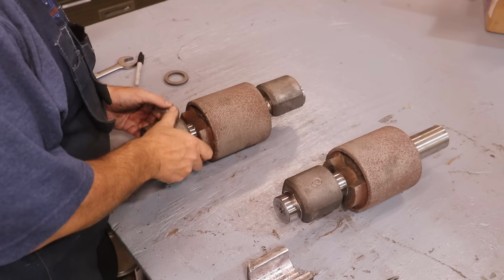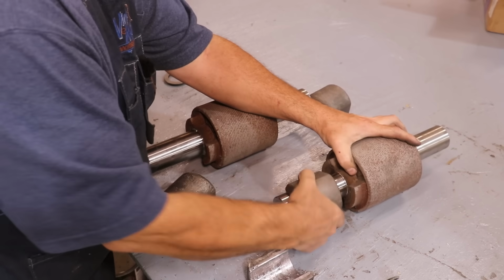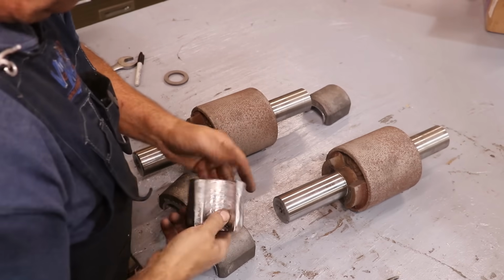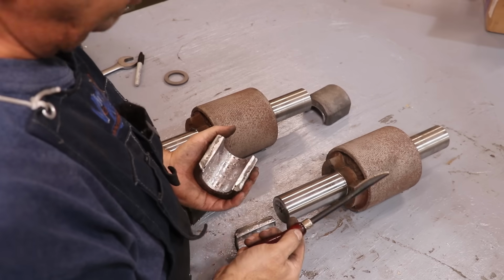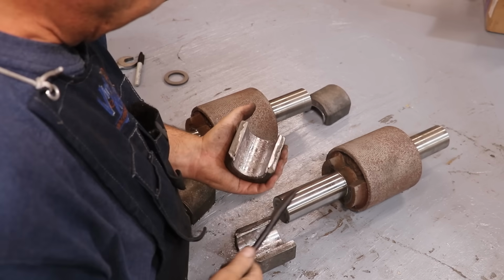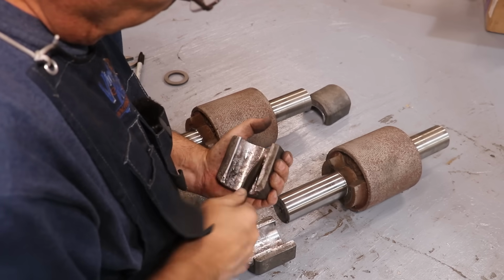So I'm over here, and these bearings fit pretty good. That one is maybe at least a little bit tight. This one, for whatever reason, is a little bit tight. So we are probably going to have to do a little bit of scraping on these two. This is a Babbitt scraper. This little curved shape in the bottom is for doing circular patterns like this. You come in here and it's sharp enough that it will cut that Babbitt and scrape it out.